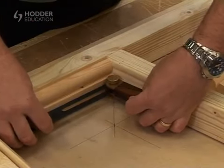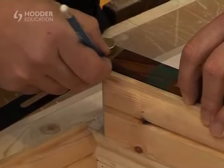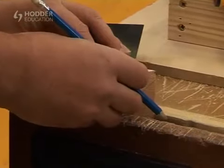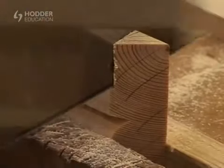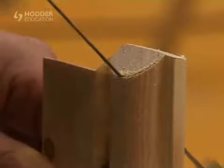Adjust a sliding bevel to match the same angle as the internal corner and mark this angle on the cut end of the skirting. Repeat the method demonstrated to cut the other scribe, only this time the angle of the saw cuts will be slightly increased. Remember to undercut the scribe to ensure a tight fitting joint. The top edge of the scribe joint will be visible after the joint's been fitted, so it's important that this portion of the scribe is not undercut.